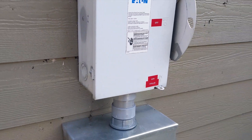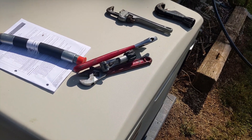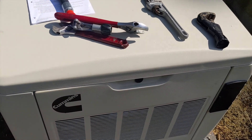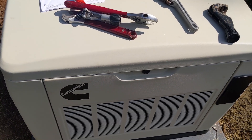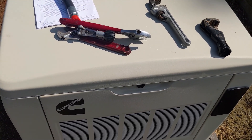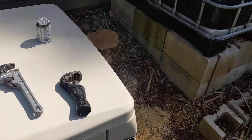It uses a two-wire start control, or he can come out and manually start it at any time. It is set up to exercise bi-monthly for about 10 minutes. We set it to 5 o'clock on Friday night when they have guests — we'll just fire up the generator, though it's pretty quiet. Anyway, that's the plan on the generator — the gas company is plumbing the gas in now, so I'll actually be able to test it before I leave, which is wonderful.